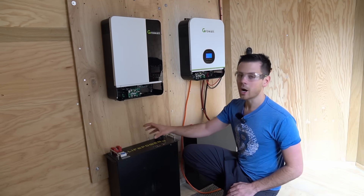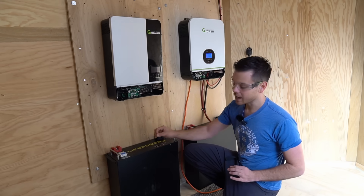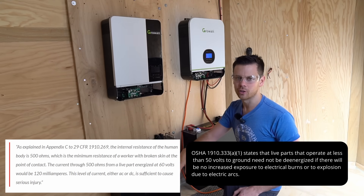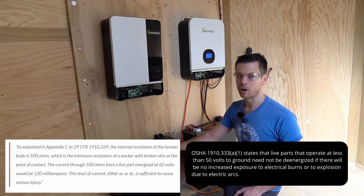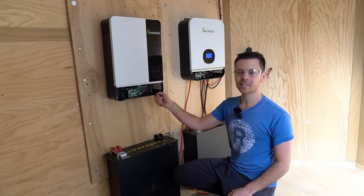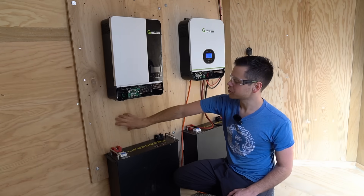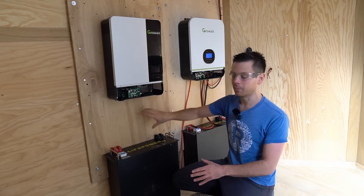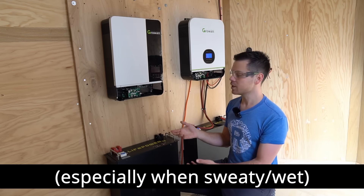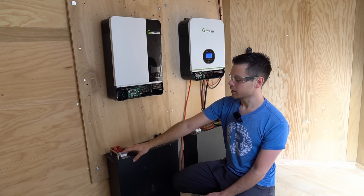If you follow the protocol for building these systems you'll never touch 48 volt conductors. Keep in mind that when these batteries are fully charged they can kill you — people will argue and say they've touched 100 volts no problem, but enough current through your heart is instantly fatal. That's the only downside, and it's not that hard to build a system without touching high voltage. Previously you'd have circuit breakers, a shunt, and all this stuff on a board that could shock you, but now we have all-in-one systems and server rack batteries with a circuit breaker built in.